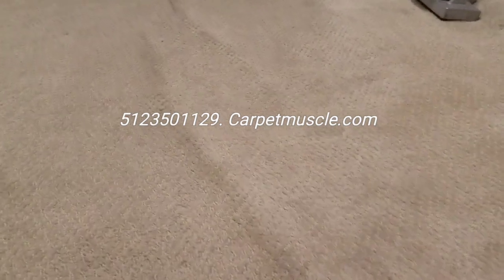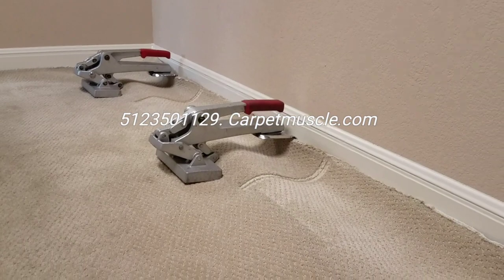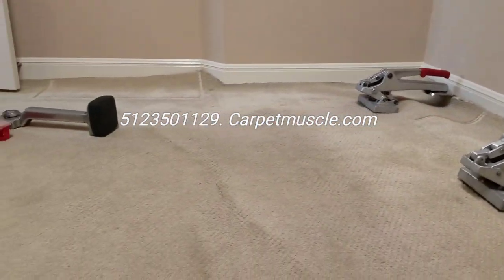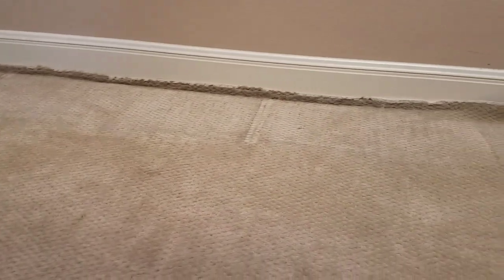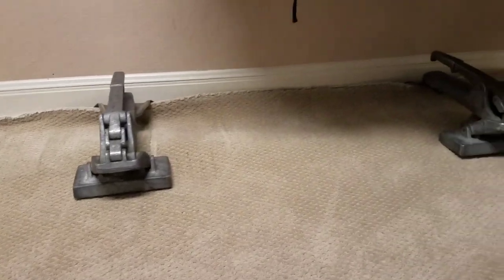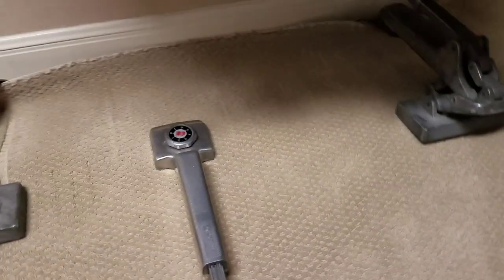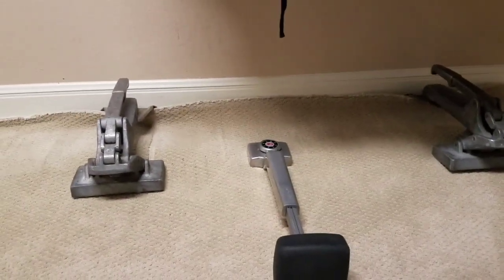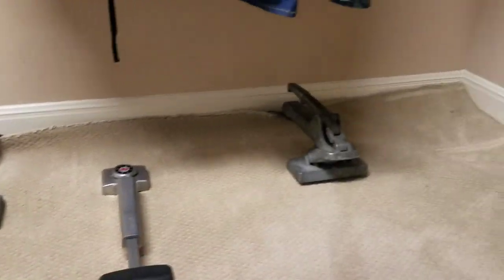After cleaning it — this is my helper here, that should come out. I'm gonna tuck the carpet in and then cut off the remainder. I take the stretchers off one at a time and continue to use a knee kicker. I kick between them to the wall, tuck it in, pull the stretcher off to the left, secure that, and just keep working my way down the wall.